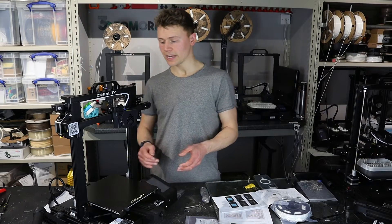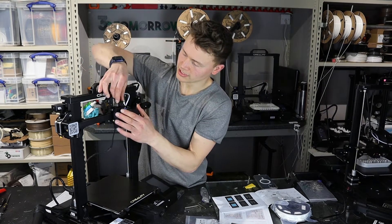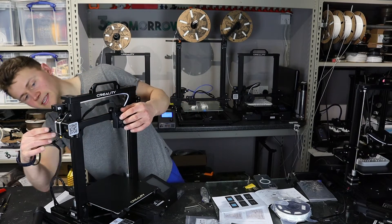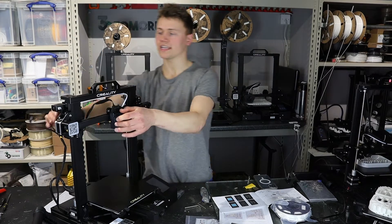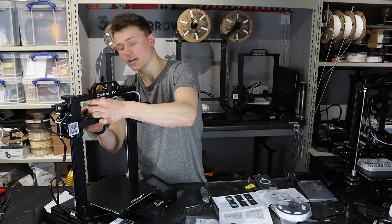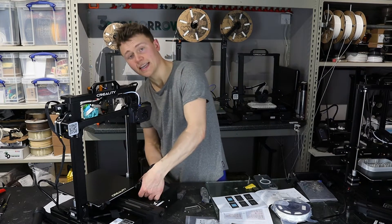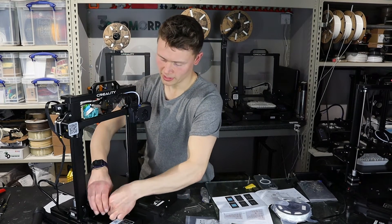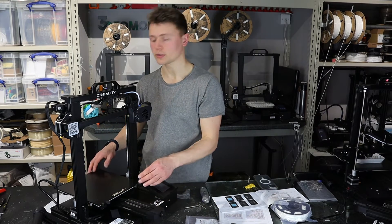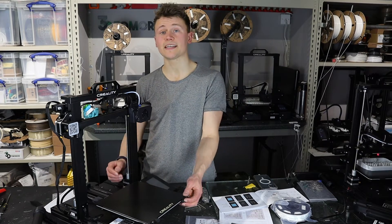Step six is the cable connection. We've got the main cable here for the hot end — that comes down and goes into the adapter here, nice and quick and easy. Then we've got the other side of that cable which comes around and clips into the back there, which powers the extruder itself. We've then got these little securing rings which can be used to hold the Bowden tube to the cable and help constrain it and reduce wear. We've then got a cable at the front which plugs into the touch screen, a cable at the other side for a Z optical sensor, a Z axis cable for one side, and another cable for the stepper motor Z axis on the other side. With that all clipped in, that's all the cable connections dealt with.